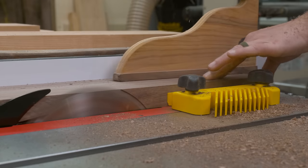Next it was time to trim down the chop to its final length — now that the bench top was attached, I could mark that out and head back over to the miter saw. The base of the chop gets a little decorative touch. I played with a couple different designs but ultimately landed on a nice taper at the base. Once I had my two tapers laid out, I brought the chop to the bandsaw and cut down the line. I also lopped off the top of the chop to give me more breathing room when using handsaws — if I didn't cut this off, I'd be punching the top with the chop anytime I was trying to make a cut. To clean up the saw marks I used my bevel up smoother, and finished it up with a card scraper — this top is super smooth.